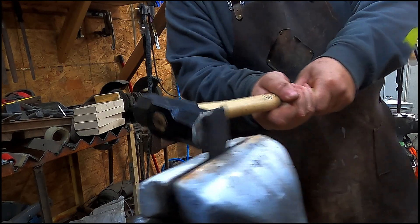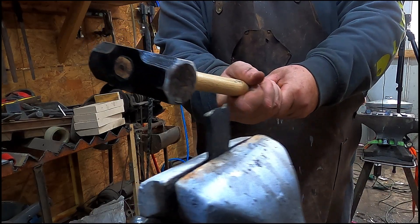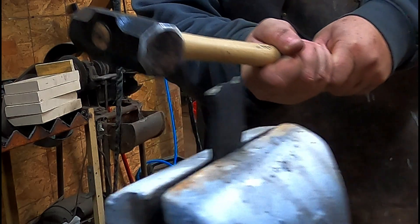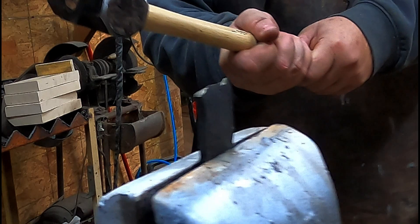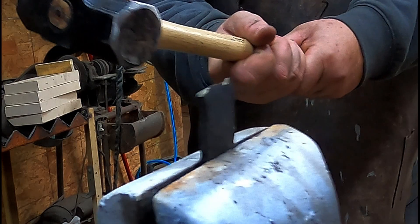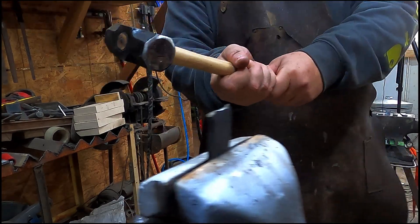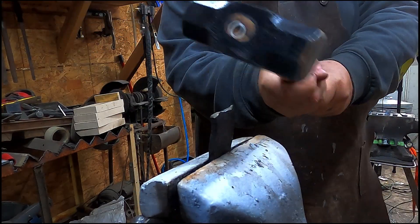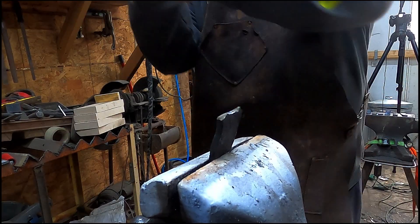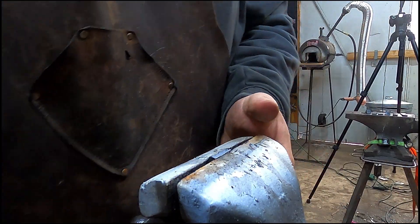Based on the water quench post-temper, I kind of expected this to move a whole lot more — but actually it didn't. I was really surprised it moved about the same. It had the same amount of rigidity; it actually felt very similar to the water quench, and this is the oil quench. It just didn't want to go. Now this could partly be that it's a shorter piece with less leverage, but we're comparing water versus oil head-to-head.